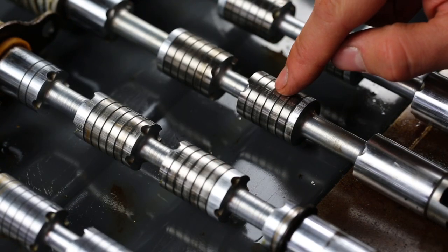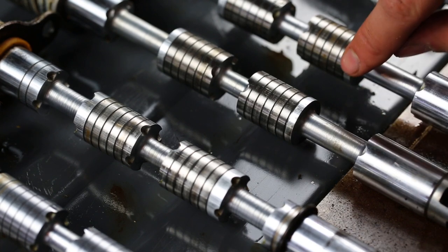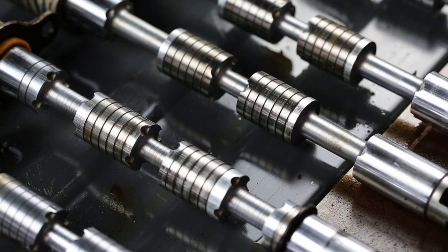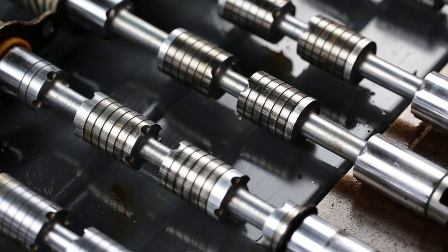Now focused in on this spool for one of the stabilizer cylinders, you can see that it also has some of those scratches in it, although this one in particular has a lot of scratches on the very end there. Both stabilizer cylinders have that same wear pattern. After taking apart the valve body and inspecting this wear and the rest of the valve body as well, I think that the wear on these spools is what's causing the leaking inside the valves.